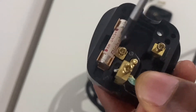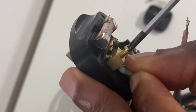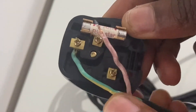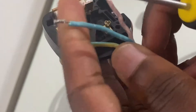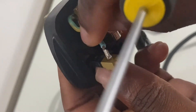I'll be rewiring the plug here. If you haven't got enough space for your thick wire to go in, open up the clamp. Once you've got your earth wire sliding through, tighten the clamp back onto the pin. Repeat the same process for the neutral wire, which is the blue wire — it goes on the left-hand pin, one of the shorter pins. Open the clamp if there isn't enough space, push the wire in, and screw the clamp back onto the pin.